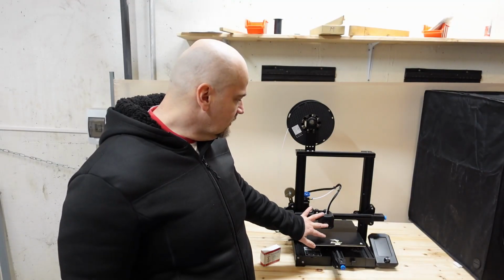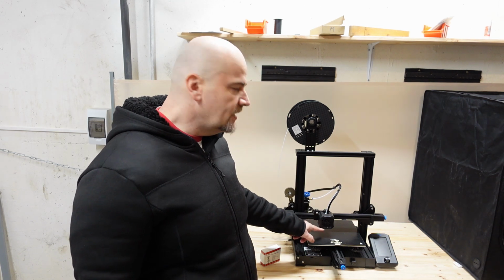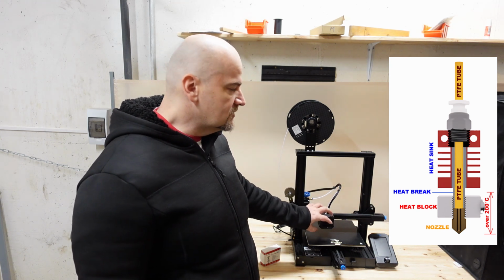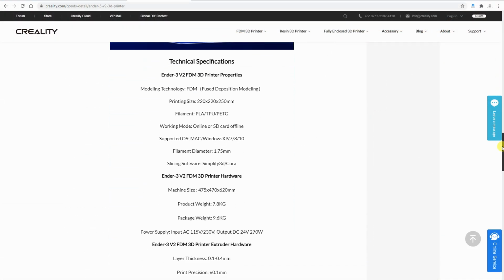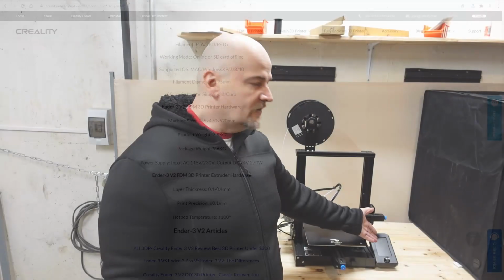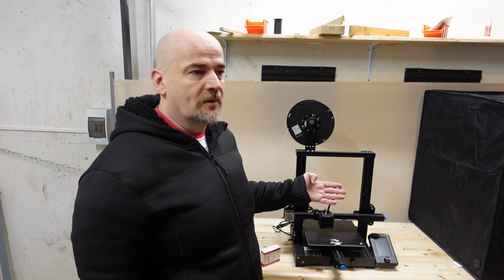The structure of this hotend on Ender3 is that this Bowden tube or Teflon tube goes inside completely down to the heater block. So this means that this is the weakest point of this structure, because in the heater block, if we want to have, I don't know, 250 or 260 temperature, actually that temperature will touch this Teflon tube. Even on the Creality website I couldn't find the maximum recommended temperature. Of course, with the settings we can set up to 260 degrees Celsius, but with this Teflon tube most of the experts don't recommend to go over 240 degrees Celsius.